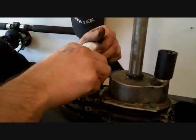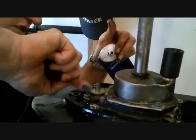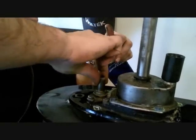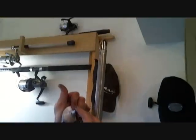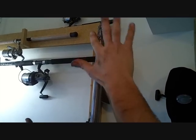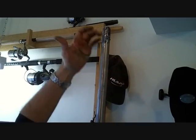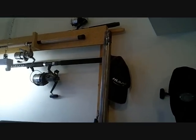This is your gear shift. Lift the gear shift up and put some grease on the spline of the gear shift, then slide it back on so that it doesn't seize on there. Up here, put a bit of grease on the upper spline of the drive shaft. Now make sure there's no grease on the top of it — wipe your hand on it — because if there's grease on the top, it will hydraulic into the crankshaft. Now let's go and install it.